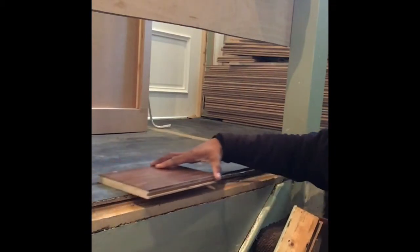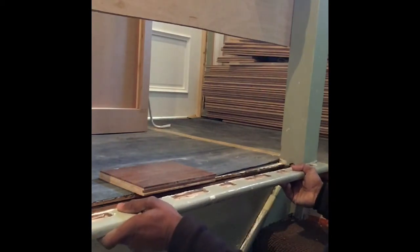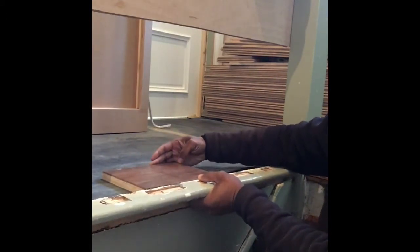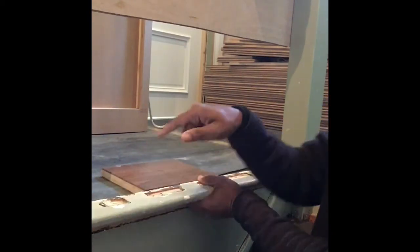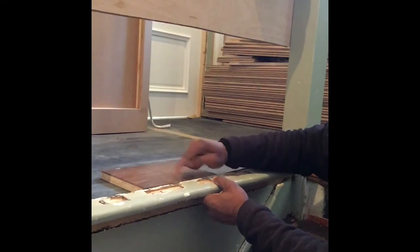Fit the new piece of floor, and then trim the existing nosing and fit it at the new height so it finishes flush with the new piece of floor, so that it will look like the original. I do that all the way around and across the step, and then all you do is you put a piece of scotia underneath, a decorative finish. Yeah, it looks exactly like it did originally, only now it has a brand new floor and no secondary step.